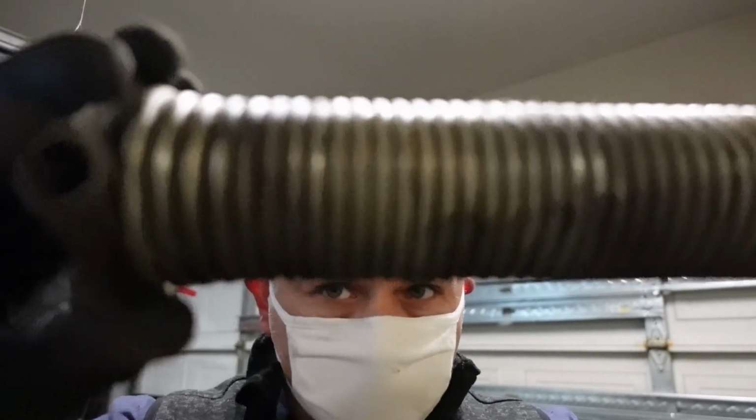Okay, so you know how when you go down the rabbit hole, things start to make no sense? Well, this is one of those things, and it doesn't make sense, and at the same time it does make sense. The spring that I've just loosened up there is a 225 wire. It's a 225, I think like 29, and I'm thinking, oh my goodness, they applied one spring that was tremendously weak for this door size.